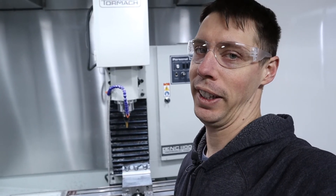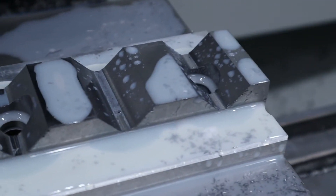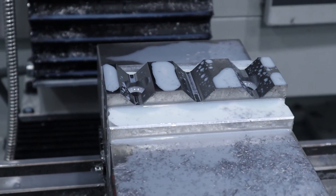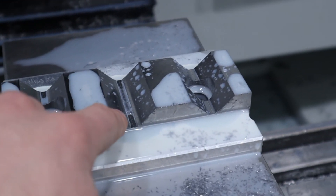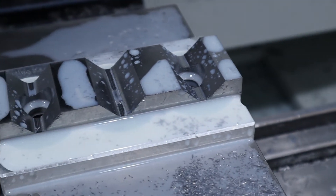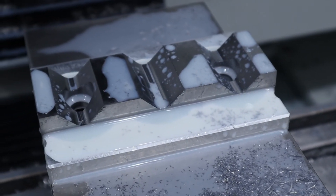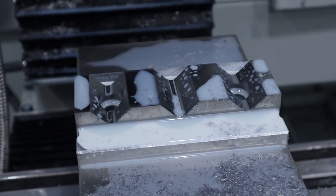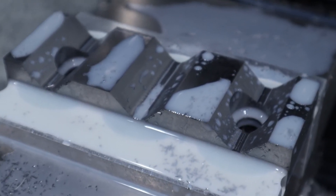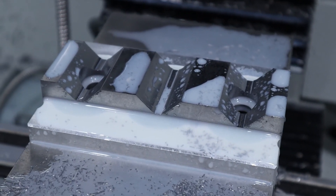That ball end mill is done. It is beautiful. I kind of felt dumb after I let it run for a while because you can probably hear a thump when it hits the bottom of the V. I think it's because the tool is engaging on one side and not fully disengaged before biting into the next side. If I would have run the passes 90 degrees the other direction I probably would have avoided that — shocking the tool like that isn't good. On the second one I'm definitely going to change the pass direction. But it turned out sweet. The only thing left is a little chamfer and then this one will be done.